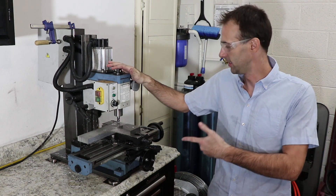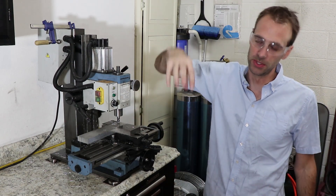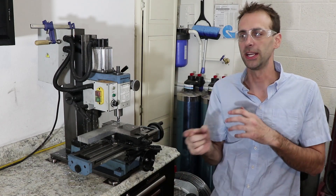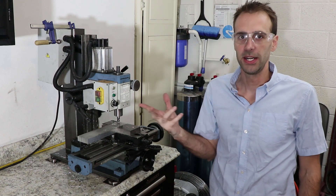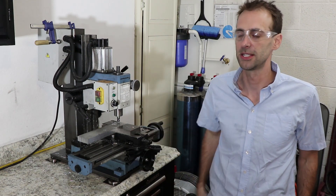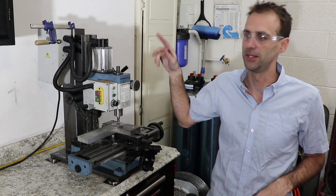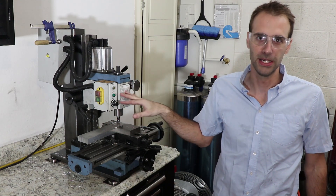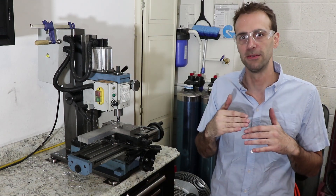I can definitely tell there's a big difference in stiffness. The really high pitch noise you hear is actually the tool unscrewing as it's cutting — as it grabs and pulls in the perpendicular direction of the cutting flute, it actually unwinds the tool down. I tried to use a decibel meter to tell before and after, but that high pitch frequency was all it was measuring, and there's no way to filter it out with that instrument. So I'll take the footage from the camera right next to the machine and do some instrumentation on it to see what we can find.